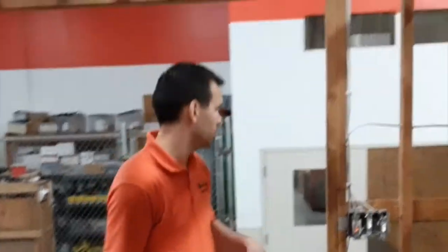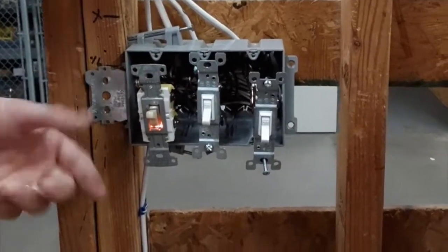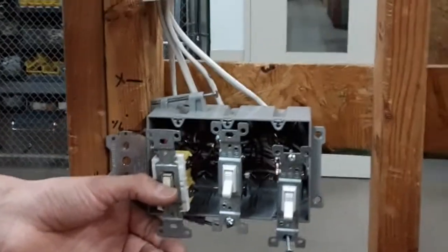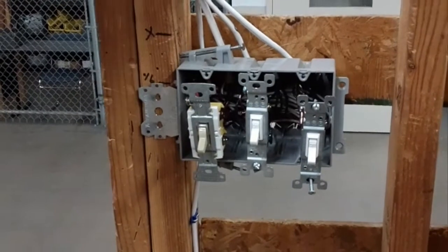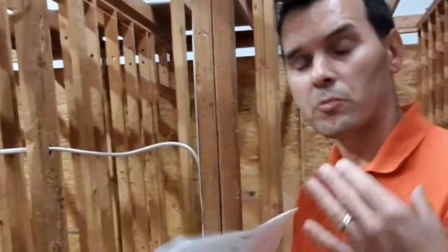I'm going to show you a couple of concepts. I've got a three-gang box here. I did not screw them in because I want to show you the wiring inside. This switch right here is going to control our fan with a light up above. This concept gives me an option to control the lighting from two different locations, which is called three-way switches. The other switch is on the other side, and I can shut it off from this side — so I can turn it on from either location.